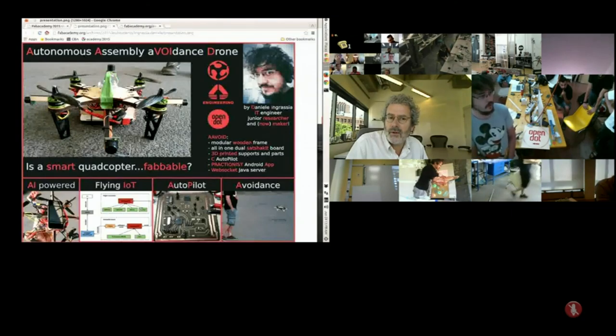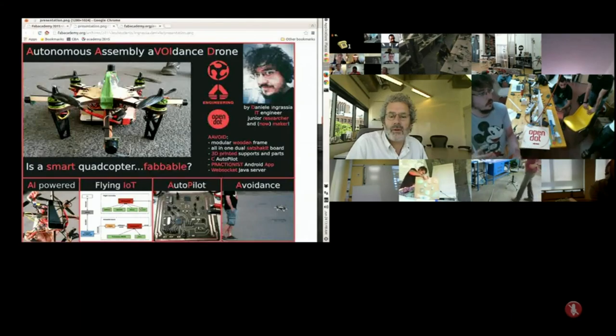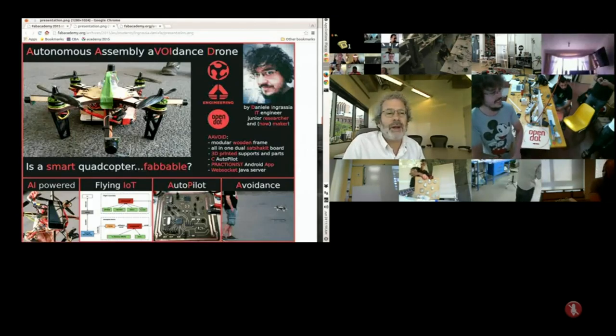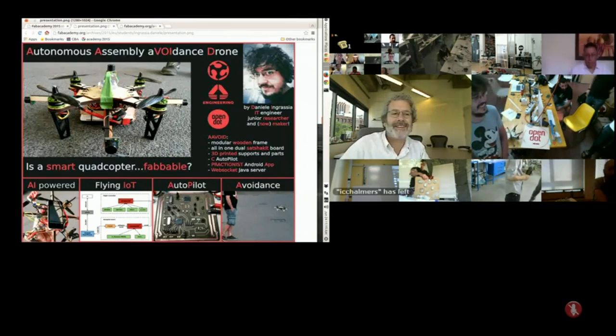Yes, okay. Mainly the control is made by MultiWii software, and I just write some commands in its serial protocol when an obstacle is detected. The pilot is in charge of controlling the drone, but if an obstacle is detected, the autopilot will take control, read the last commands from the user, and try to softly adjust them in order to avoid the obstacle. When the obstacle is no longer in the field of view, the autopilot gives the control back to the pilot.